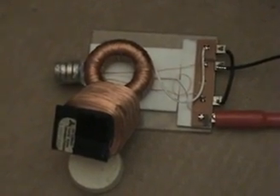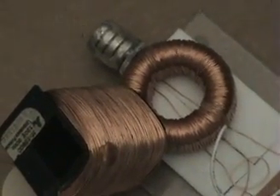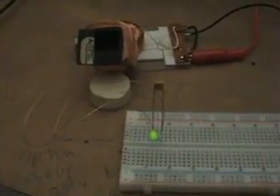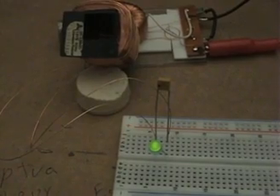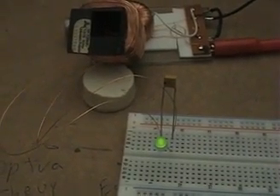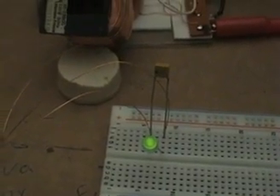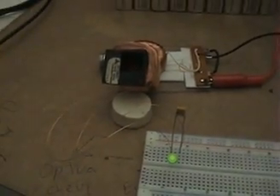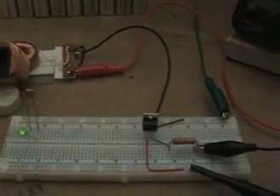Here is a video with a pickup coil, which is a coil from a shaded pole motor that I've added to my pulsed toroid. I have that coil going to my breadboard here, with a capacitance of 220 picofarads and an LED — a regular LED connected there — and as you can see, that LED is lit.